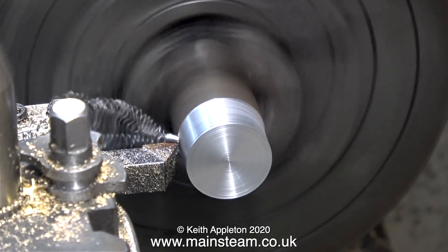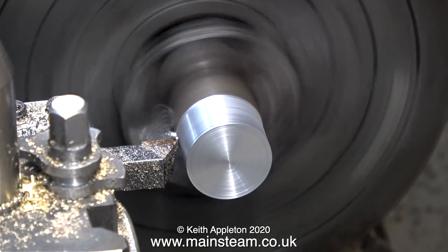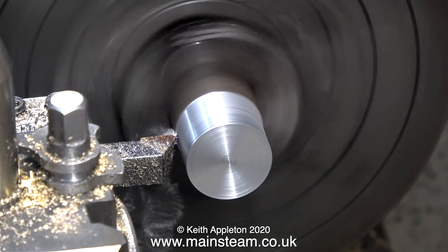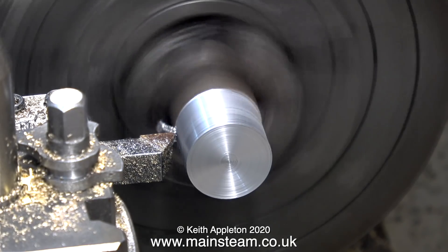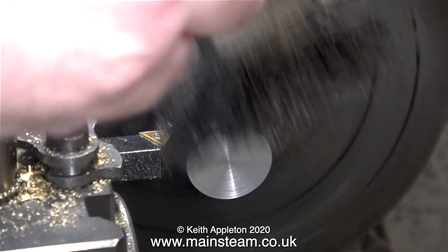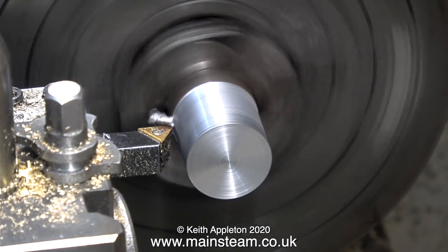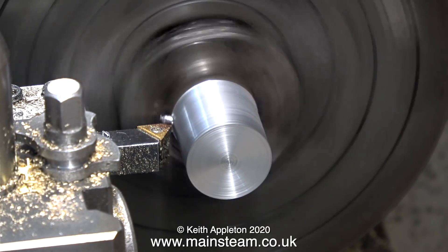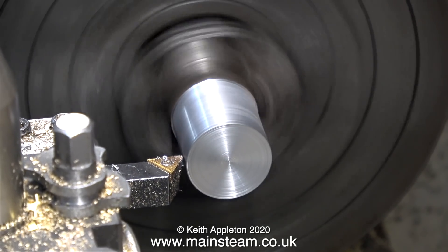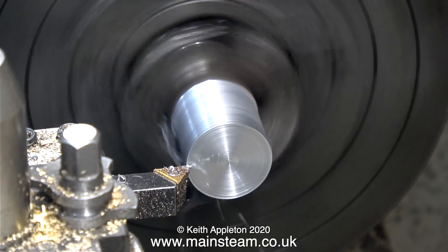In this clip I'm turning the outer diameter to match the measurement I obtained using the micrometer from the original eccentric sheave. I'm not getting a very good finish on this piece of steel — it's not free-cutting steel, it's quite a hard piece. The reason for this I think is because the lathe tool has done quite a lot of work and the tip's a bit blunt. It's time to turn it round to a clean piece, but before I do that I'll take all the roughing cuts, because the finish at this stage is unimportant. When I need a nice finish I'll change the tip and try again.